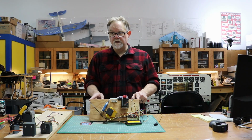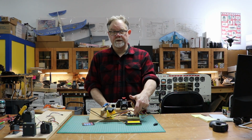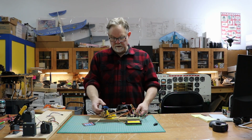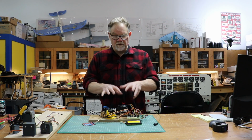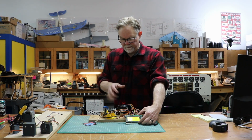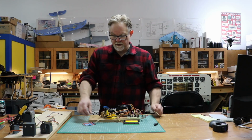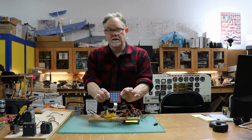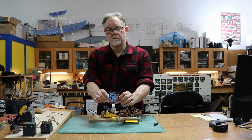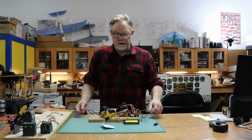It's not much. It's an Arduino Nano, a stepper motor driver, an extruder drive from a 3D printer, and a servo to drive a pair of side cutters. This is the first version of that machine, and it's got a little display here, and it's not completely working anymore because it's been partially disassembled, so I'm not going to show you how it works. But it asks for the length on startup, and using this little keypad, you enter the length, hit enter, which is the # key here, and then the number of wires you want, and then hit enter, and it'll sit there and go through and just cut the wires.